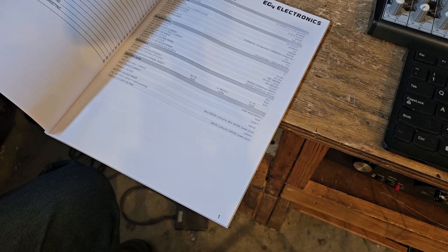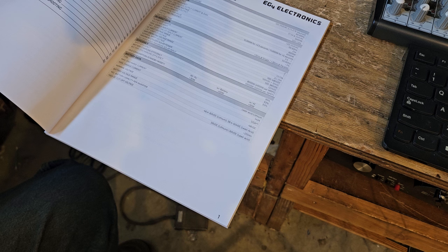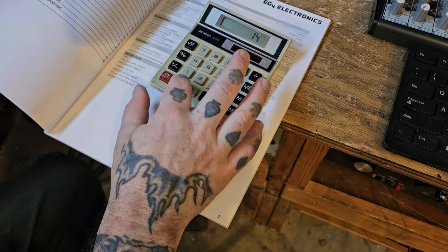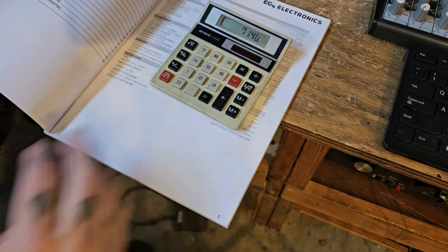So I guess that means that basically I have enough batteries, so you just want to be, well, actually maybe I don't. You'd want like 100 amp hours, somewhere around that, at 48 volts. And so that puts you a little under, because it'd be about 51.2 volts for the thing fully charged, and 100 amp hours would be like 5.2 kW. So that's why they're saying 140, because let's see if we get this thing to turn back on. Well, 140 times 51 is over 6 kW.